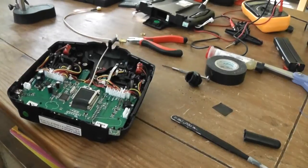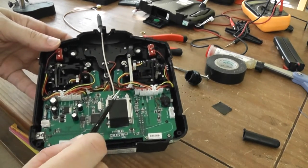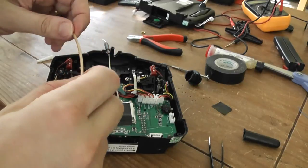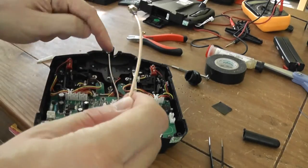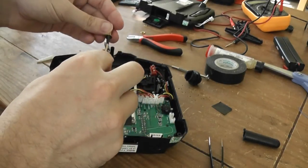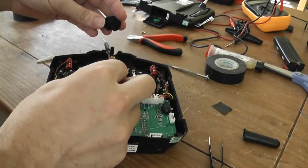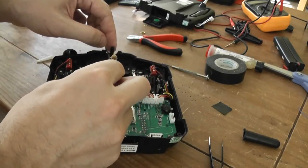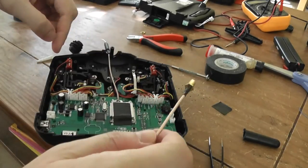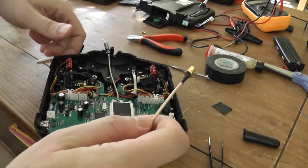Correct. Well, in order to prepare the antenna installation, you have to know, for example, that the RG316 cable is larger than the actual one. I guess it's 178, not sure. You will notice that when you try to use this antenna mount, the screw locker there will be blocked, and I think I will remove it. It means that the radio will be closed by only four screws. Should be okay, it won't be so dramatic.